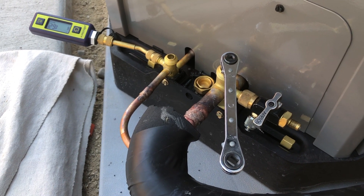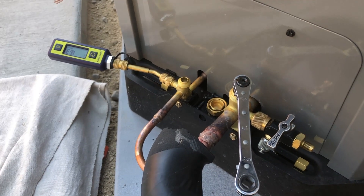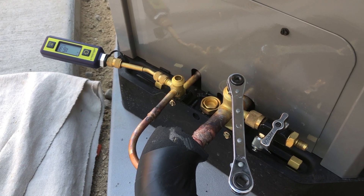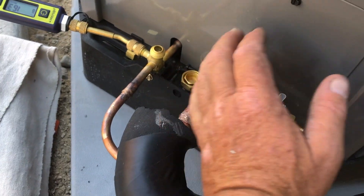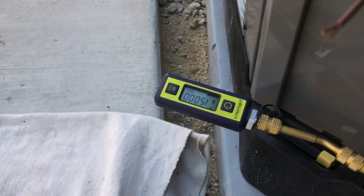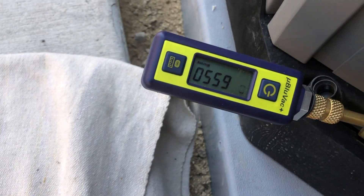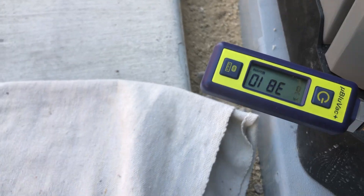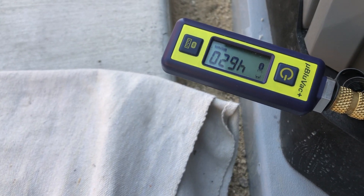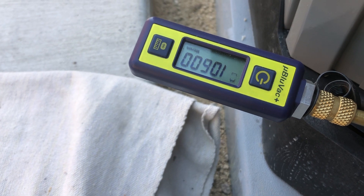I had a question on how to open up my valve after vacuuming the unit. We're down to 162, so I open the suction line first and wait for it to rise. Right now the suction line is getting blasted with refrigerant and oil.